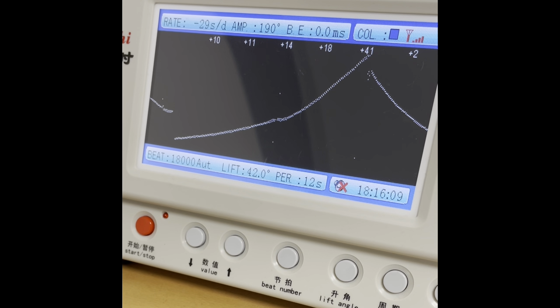These never seem to be the best timekeepers, even when I've had ones in good condition, in terms of chasing as I go for chronometer grading. But that's not what this watch is for, and I think the customer would not pay for the time of poising it. I can do it, and I will probably do it on one of my own watches in a later video, just to demonstrate how that works, and see how accurate we can get something that's got a bit of positional variation on crown down, crown up, left, right, etc. But that's for another day.